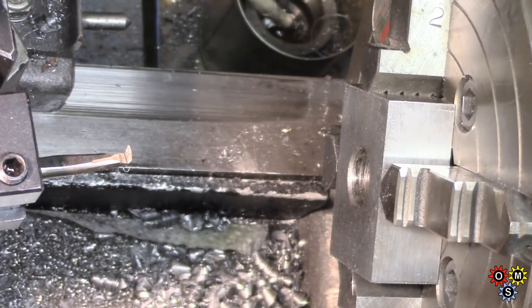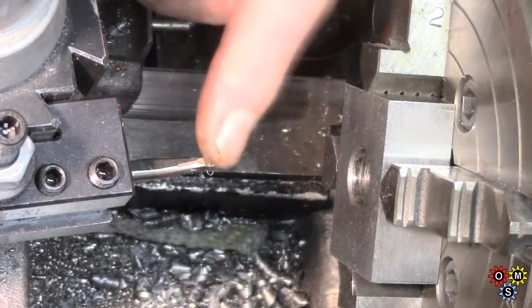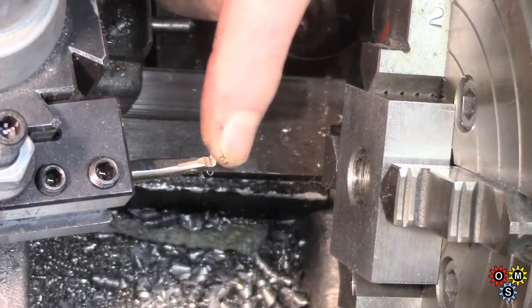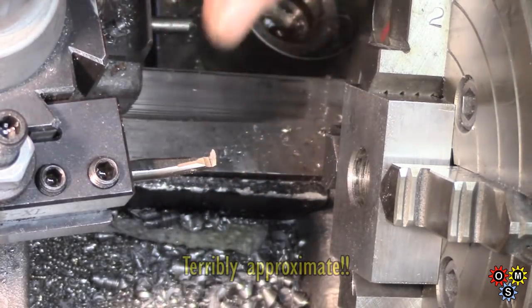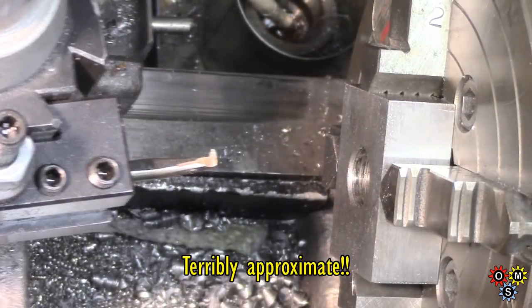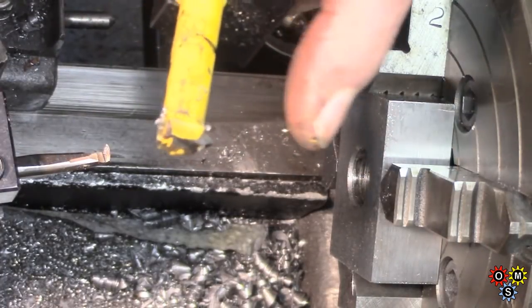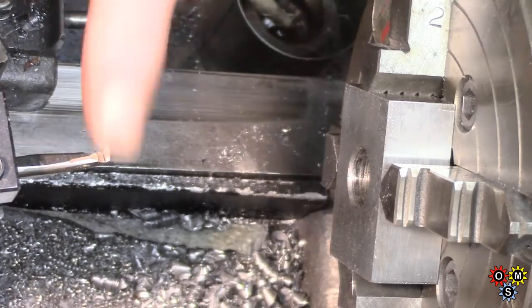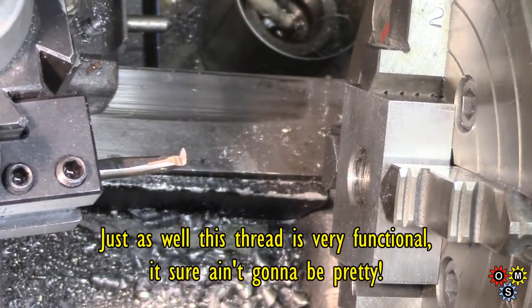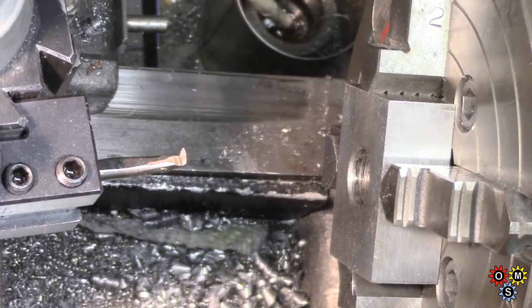This tool I've got in here now, you see the weird angle, and it's got to be cranked because I think I used this on another job. It's very crude. It's a sort of thread cutting, but it's extremely crude and there's not enough left to really regrind it. But this one, although I did grind a little bit of extra relief underneath, I think it was starting to bind. I was taking a cut and nothing much was happening. So I'm going to have to use this silly little thing. Just do it in small steps, otherwise it'll be a bit flexible. So it's not going very well at the moment, but I think we'll get a result eventually.